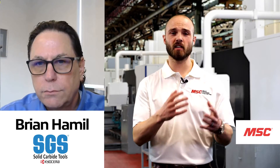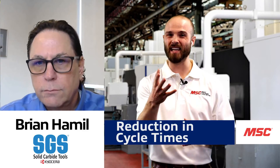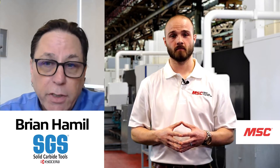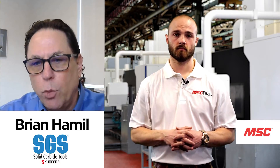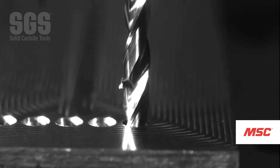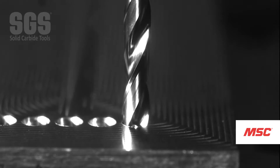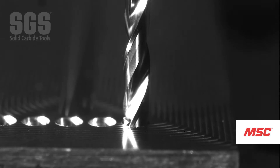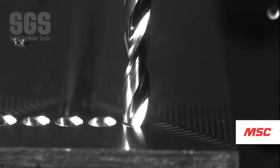What really defines the greatness of a tool is the user experience. When it comes to reduction in cycle time, we see less need for peck drilling — where you step the depth of the hole in multiple increments. We're able to achieve higher surface footage, and one-shot drilling is really the key to that cycle time reduction. The way this drill self-centers eliminates the need for a spot drill, and the flute shape and coolant flow help eliminate all those peck drilling cycles required with other drills.